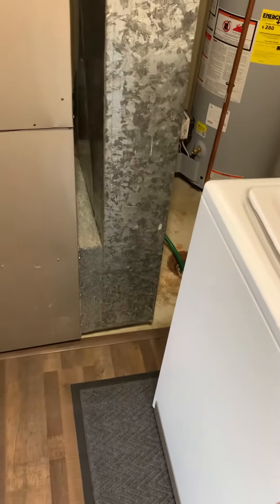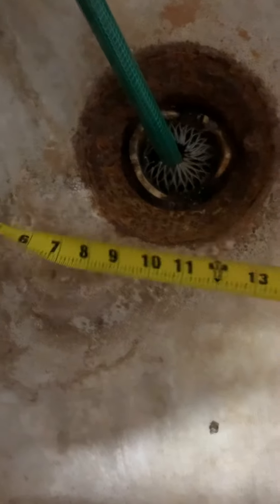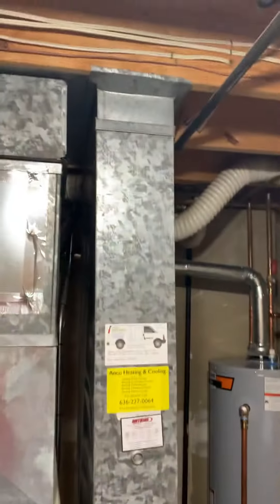Obviously keeping in mind that we only have about seven inches before we're on top of our drain, so we should be good there. We're gonna gain two here, gain four here, so that puts us at six — we'll be right on top of it, real close, but that's gonna be our offset over for that.